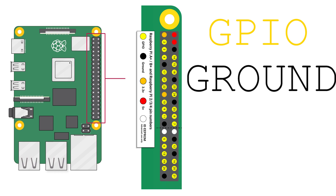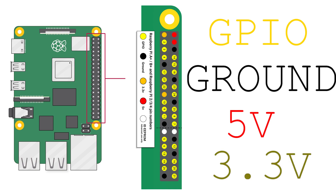The black colored dots are ground pins containing zero volts — they are used to complete an electronic circuit. You can think of the black ones as negative and the red ones as positive connections of the circuit. Raspberry Pi operates with 5 volts, but you will also find 3.3 volt pins — anything connected to the 5V pin gets 5 volts, and the 3.3V pin always delivers 3.3 volts. The white ones are special purpose pins, which we'll cover later in the course practically.